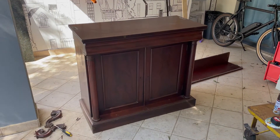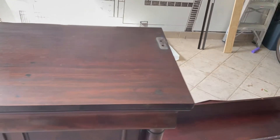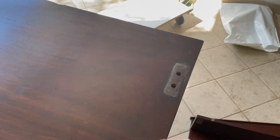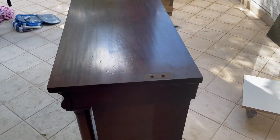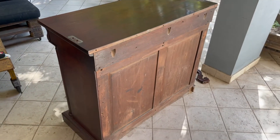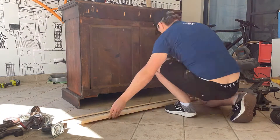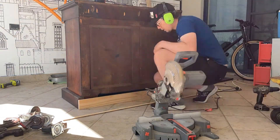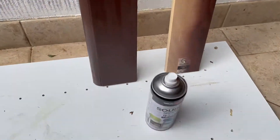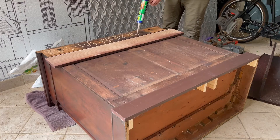I managed to get that cabinet for just $150, which was a great deal, and I've already taken the top off it. As you can see, it's left a couple of holes on the top surface which I'll cover up when I put a bench top over it. I just need to dress it up and repair a bit of the woodwork at the back — replace the skirting and a panel across the top. I've cut those pieces of timber to size and stained them using brown-coloured spray paint, which was a quick and easy way to match the colour to the rest of the cabinet.